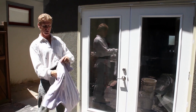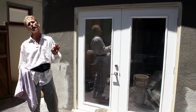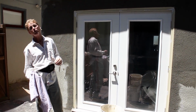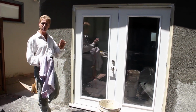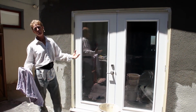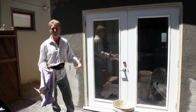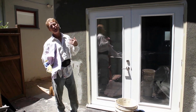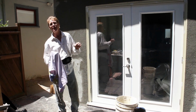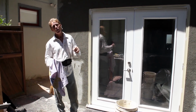There's nothing to it. So all you guys from the UK who say, Kirk, we see all this 1 coat stucco and it says do 1 coat. You can do it, but you better know what you're doing. If you don't, do a scratch coat, come back to it, do a brown coat, let them sit. Actually, you could even do it the next day too. Put your scratch on and do the brown because you guys will drop a lot of mud. I have the benefit of Jason or Lou. They make me look good because they're experts at mixing. Plus Jay's a licensed plasterer too, so he knows exactly what he's doing.